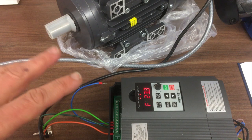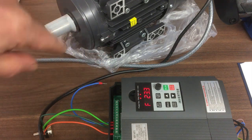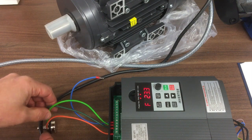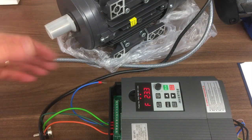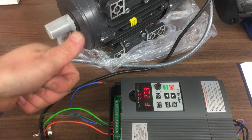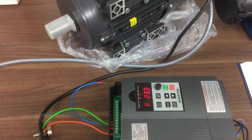So the next thing we're going to get working is for the thread tapping. We want to jog the machine at a given fixed speed. So I want that to be independent of what we've got this set to, because I might have just drilled a hole at a certain RPM, and you just want a fixed, fairly slow tap into the material and then tap out slowly at the same speed.